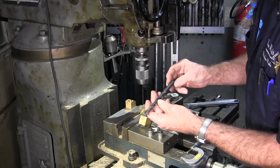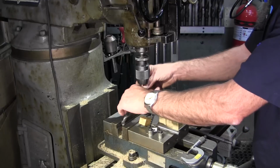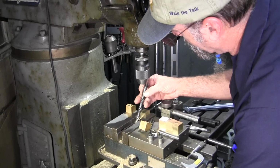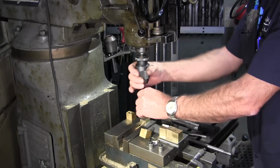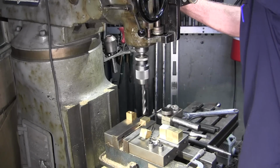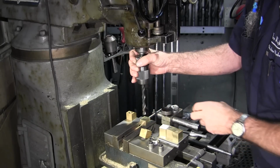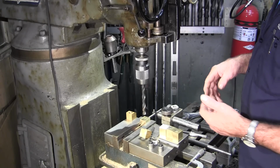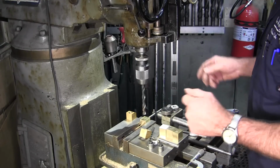All right, and we went ahead and picked up a drill. We're going to drill this tap size 15/32. Should put the most meat around the threads for the tap. Now also, this drill a while ago, we ground flats on this. This is free machining brass, and we want to make sure that we're not grabbing and this thing's not diving and choking up on the bit and becoming a nightmare.